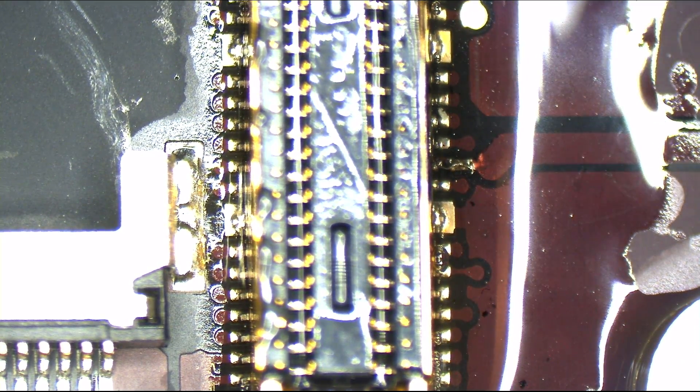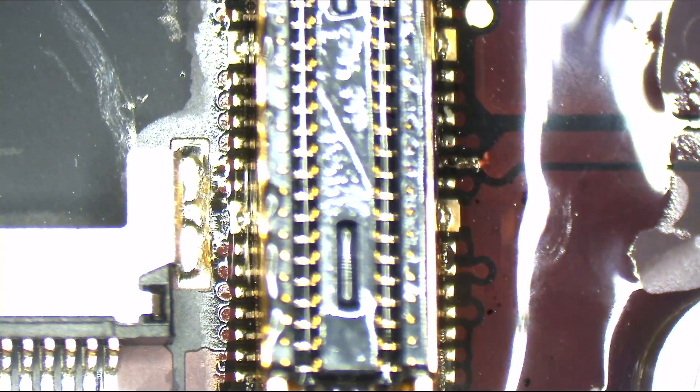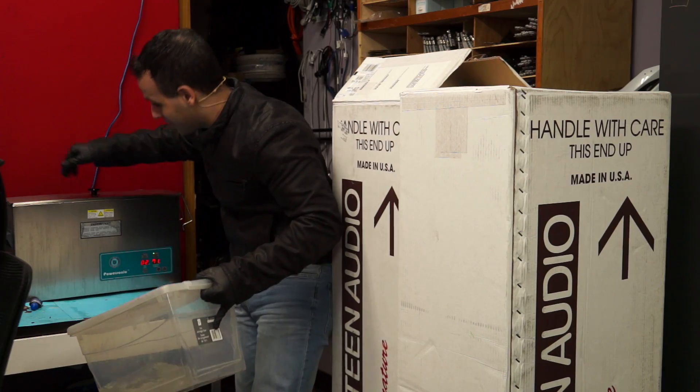These pins are really, really small and very hard to get to, so we used a micro-soldering pencil — the Hakko FM2032 — to get to those pins. This micro-soldering pencil can be found in the links below. While I think terribly of Hakko's hot air stations, I think highly of their micro-soldering pencils — they're very nice, ergonomic, with a nice grip, and work very well. Their hot air stations? Garbage. But the pencil, very very good. We were also able to use our Crest Ultrasonic Cleaner to clean the board and get the CPU to work. In the beginning it was turning on without a light, not giving us any CPU usage, drawing only 100 milliamps with the fan spinning — no picture, no backlight, no post. But the Crest made that all happen. You can get a Crest on store.rossmangroup.com — you can get just about anything you want on store.rossmangroup.com.